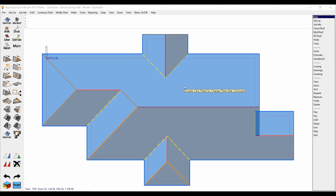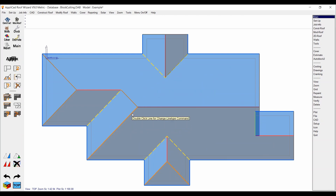Today I'm going to go through a quick block cut using this roof, as there are a few different features here we can take advantage of. First off, a block cut is really only useful when you've got a hip and valley roof like we do here. If you've got a single slope or skillion roof, you're better off using the gen panels method, mainly because there are no off-cuts from hips and valleys that you can flip and reuse on other parts of the roof.